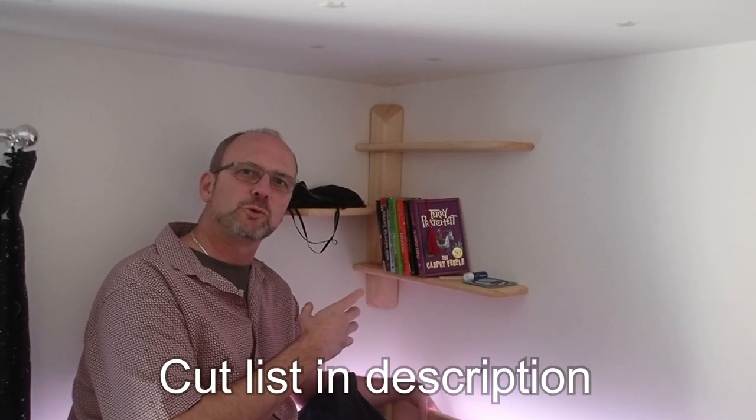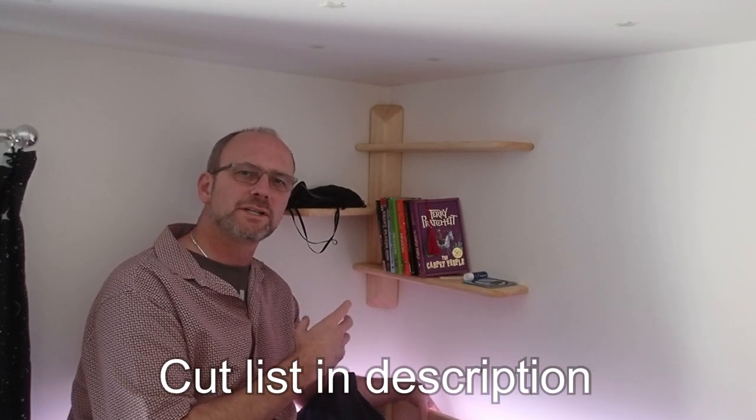Hello and welcome. For this video I'm going to be making this corner shelf right here. As far as the shelf lengths are concerned, I use the online calculator called the Saggulator to figure out how far I could go. Since the Saggulator uses two points of contact instead of one like I have here, I divided the number by half and deducted another 15% off of it. Use a more forgiving fastener if you don't have a child to worry about. I hope you enjoy this build.